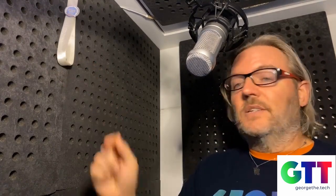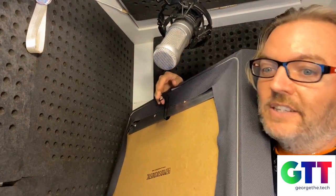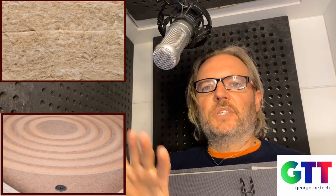I've got a strap all ready to go to provide a place to hang a panel and test, and then we'll take a listen and see how it sounds. Here's the back of the panel with a little extra hook that I added to hook the panel on this strap. What's interesting about these panels is what's actually on the inside, which I'll be showing here on the screen. The inside of the panel isn't just acoustical absorption — there's also a diffuser, which they call the diffuser core. The diffuser core is a way to get more performance out of the material inside the panel by diffusing the sound that passes through the acoustic layer. And then on the return, the sound is scattered, passing through more of the acoustic absorbing layer. That's the theory.